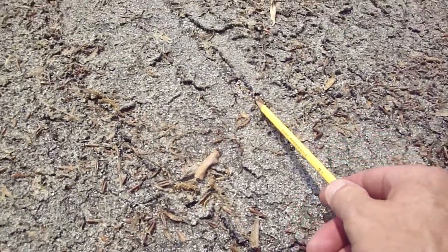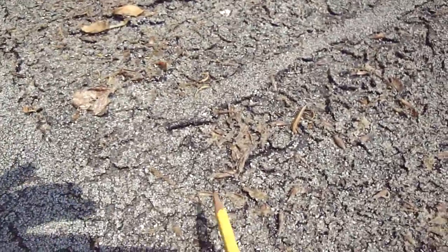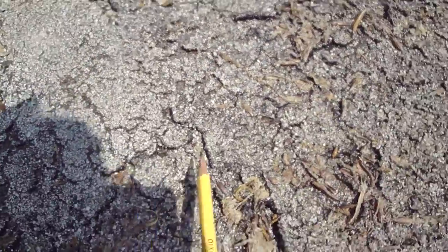all these areas are splitting now. Even this, that's the end lap, side laps don't look any better. You can see these side laps, which are the lengthways of the 3-foot wide roll, are also coming apart. You can see pretty easily what the concern is. If all this breaking up continues, especially at the seams, this roof is going to fail in the gusset center here. And it's starting to feel a little spongy underfoot. As I walk it, I can tell that there's some problems here.